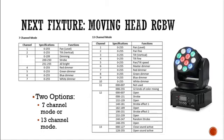It has channel three for dimming, strobe, and all-bright. And channels four through seven are red, green, blue, and white. What's interesting is channel three is actually the master dimmer. The master dimmer runs from zero to 199, then it throws in a strobe effect, and then you can have it fully bright as well.